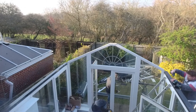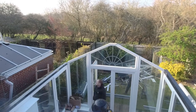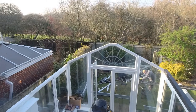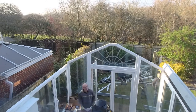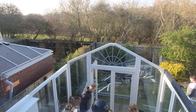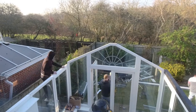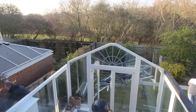We laid down a thick bead of sealant and then sandwiched the second profile on the right-hand side. Where the windows did open, we screwed from the bottom up as well as from the top down. We went with 300mm spacings to keep it nice and even, and we were dry testing and adjusting a couple of bits because we had to work around that existing part of the roof. That corner section was quite a tricky bit.